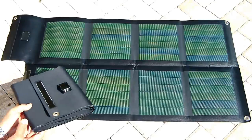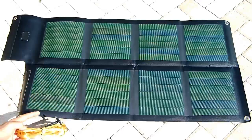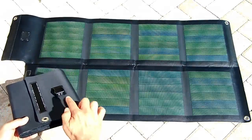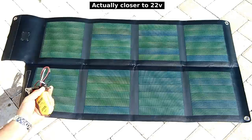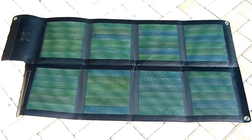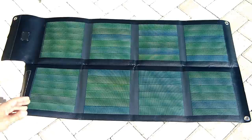The weight isn't too bad, and right on top you can see it has two DC jacks. You can take a cable like this and parallel two panels together by plugging into one and then the other, and then take the output to charge 12-volt batteries. The open circuit voltage is around 20 volts on these panels. I could take a charge controller, plug it into this panel, connect it to a battery, and the battery will stop charging once it's fully charged. Inside these panels is a blocking diode, so current flow only goes out of the panel — it cannot flow backwards into it.